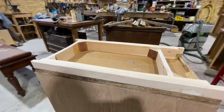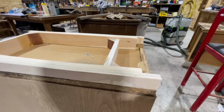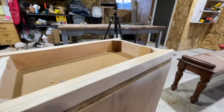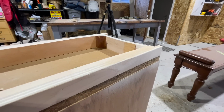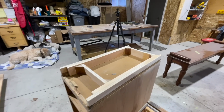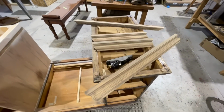I just did a little bit of sanding. There's a little bit of a high spot there, and as well on the other side it's a little bit thick right there, and on the end kind of tapered off a little bit more. The particle board probably is swollen and a little bit wonky, so I just don't want that to interfere with my trim. So I've got all the trim sanded here,